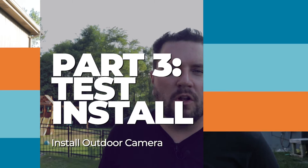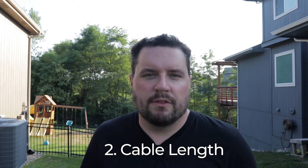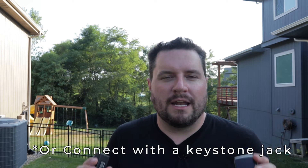The last step before getting the camera installed is to test your setup before climbing up on a ladder. There are three things I recommend testing. First, make sure your power over ethernet adapters are going to work for your camera — grab any ethernet cable, connect it up, plug in your camera, and make sure it powers up and functions as expected. This will catch any weird issues with your PoE adapters or camera compatibility. Second, check cable length — terminate both ends and connect it through your PoE adapters to make sure your cable length won't exceed what your adapters can handle.